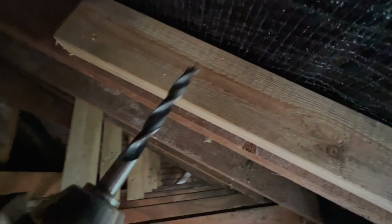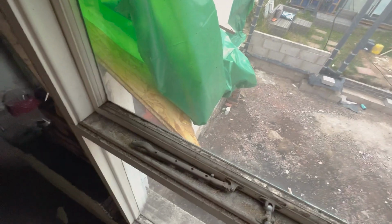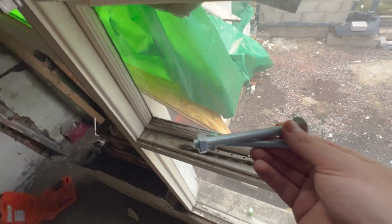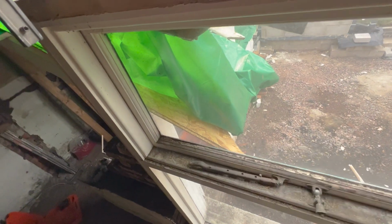Right, so that's how we're looking at the moment. You see one pin nail there, another nail there, 100mm nails going straight through. But I'm going to now drill a 10mm pilot hole through here somewhere, and quite close down the end by here, and then put through M10 100mm bolts. I think they're 110 actually. These coach bolts, tighten them right up, and I'm going to let this clamp off and see how well it sits.